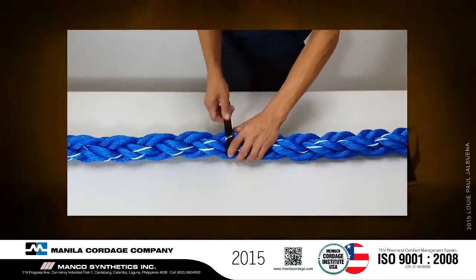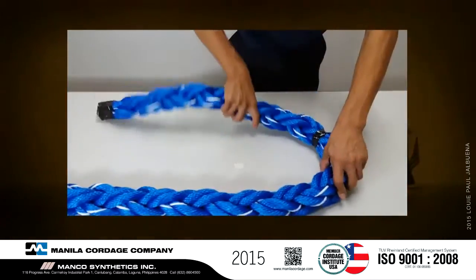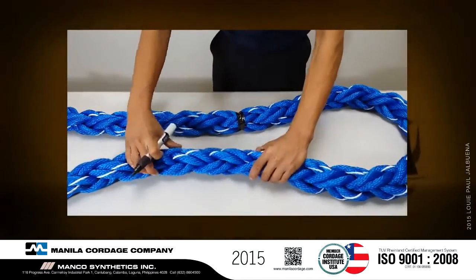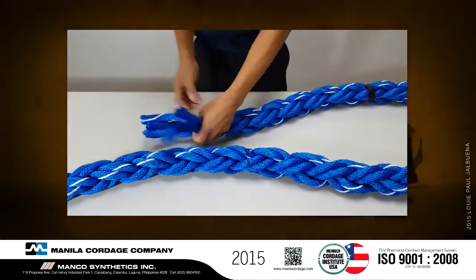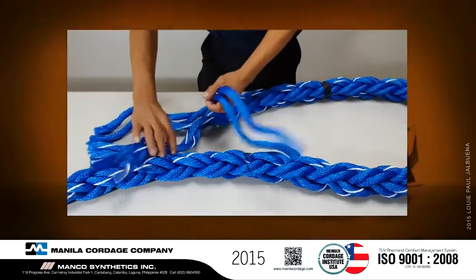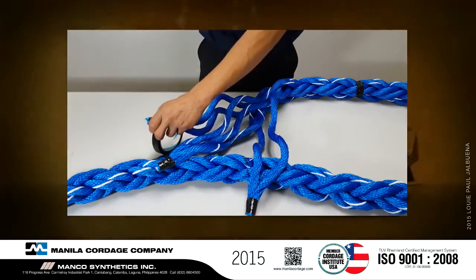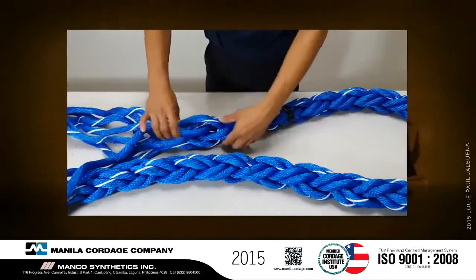Okay, let's start. Count about 7 crowns upward from the rope end and put a mark on it. Form an eye to the desired size you want, then tape it. For purposes of this video, we'll be showing you a small eye splice. A standard eye splice would be above 6 feet in diameter. Take the Z and S strands in pairs and put a tape on their ends. Unlay the rope until you reach the mark.